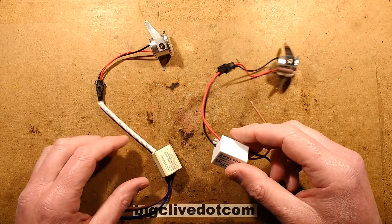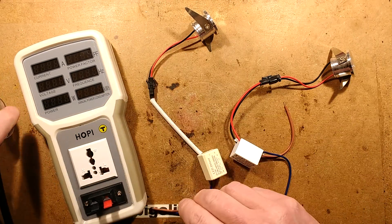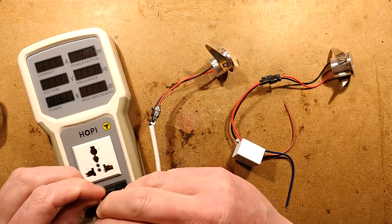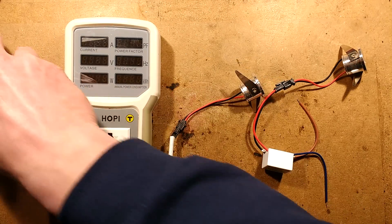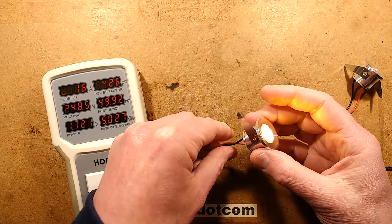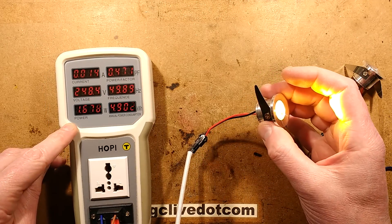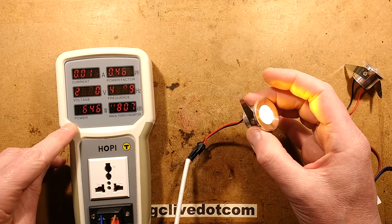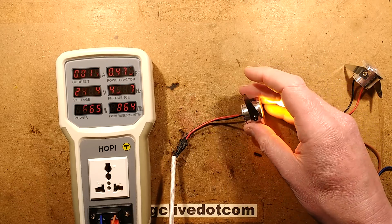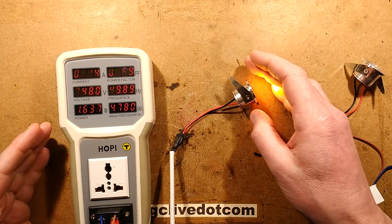So they arrived. Let me get the power meter up. Starting with the one watt one, I'll stuff the wires into these really convenient — if electrically dodgy — speaker terminal type arrangements, and plug it in. It's lit up. Holding the metal bit, despite it not being terribly wise, the power is actually about 1.6 watts for the one watt one. So that's interesting — I wonder how much of that is the LED versus losses in the power supply. The losses probably aren't too high, so it may just be tolerance driving it at a slightly higher current.